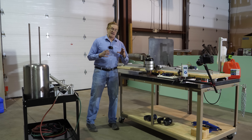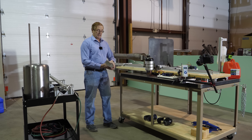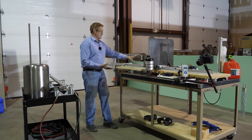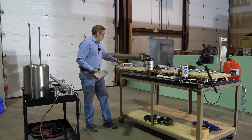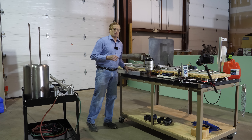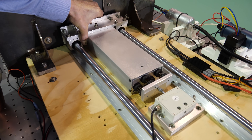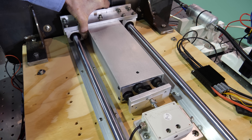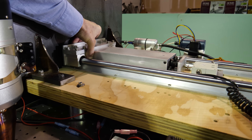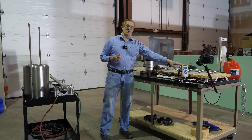In order to do this test, we had to make some modifications to our test stand. Because these engines are substantially longer, we needed to increase the length of our sliding rail that supports the engines to give them enough clearance. And because of the extra cantilever, I added an extra set of bearings here to spread the load and give it a bigger wheelbase. Because these engines produce pulses of output, I added a spring damping system to the front of the sliding rail to help absorb these peak pulses so we don't get high-intensity, high-amplitude pulses slamming into the load cell. We lower the amplitude and broaden the duration of the pulses, making it easier to detect the average thrust output of these different engines.